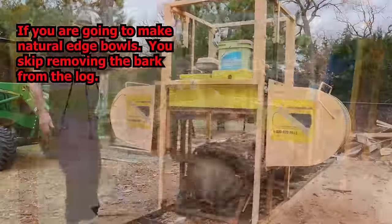Now I've used this doggy dish for several years now. I use a good brush, and I've got Anchor Seal in the bowl. I try to use up most of what's already in the bowl. One neat thing about this greenwood sealer is it'll reconstitute itself. Just work your brush a little bit, and pretty soon it'll start getting free. I'm just gonna start down here at this end, and boy, did I make a mess.